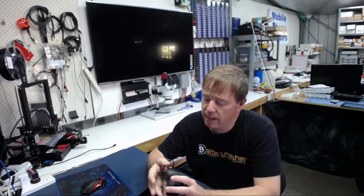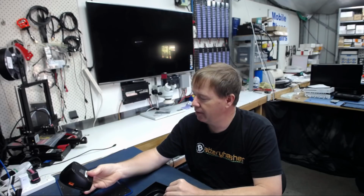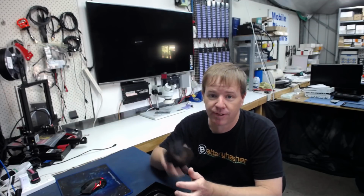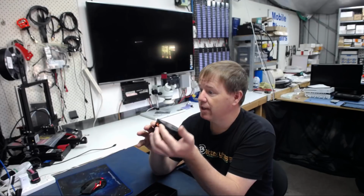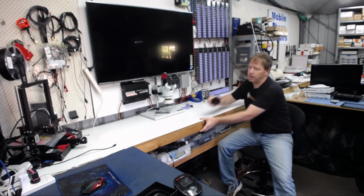But I actually opened it up the other day, and it's a T8, input max 12 to 40 volts. Input current 35 amps, output current 30 amps, maximum output power 1000 watts. Very substantial, and it's not a little unit. It's quite a little bit larger than the X6. And this is the X6 that doesn't work.